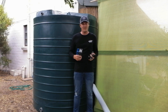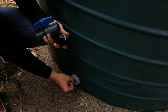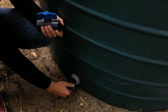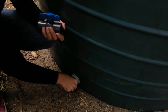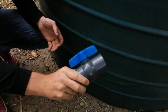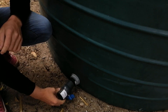Now let me show you how to put it all together. First things first, take the plug that's in here out — you might need a pair of pliers to tug it out, it's pretty snug. Then take the threaded connection and put it in, nice and tight but not so tight that you strip the threads, because then you have a problem with leaking. Then take the ball valve — preferably make sure it's closed — and screw that on.